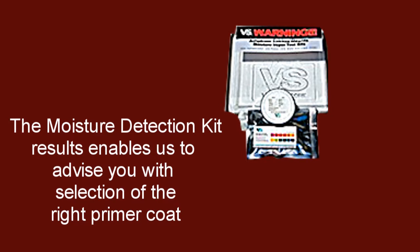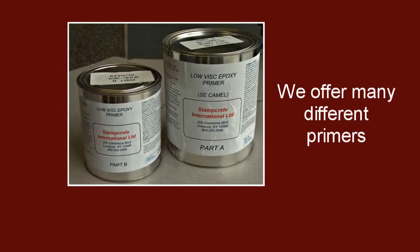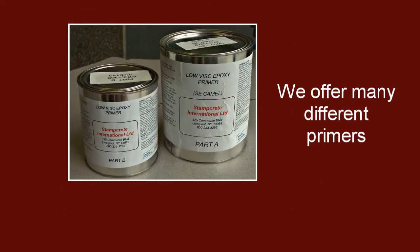And always test the concrete surface with the moisture detection kit. The test results will enable you to select the right primer coat. We offer different primers specifically designed for use on almost any surface you're apt to encounter.